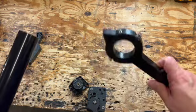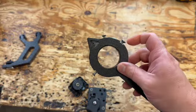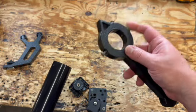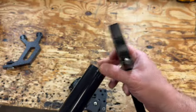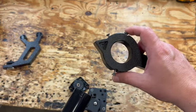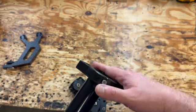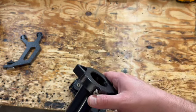So this is what it should look like so far. Now we're going to put the top handle on. This is a recent change — we now make it as a single piece. Before, we had it kind of like a clamp, and we had some issues with it breaking a couple of times, so we decided to nip it in the bud and have it where you could just screw this directly into the pipe. I've already kind of pre-screwed mine in, so I've got to line my holes up. You want to use less than a one-eighth inch bit — I would probably use something like a 3/32 bit or even a little smaller — and just pre-drill your holes. These are blunt-tip screws and they should go right in and line right up.